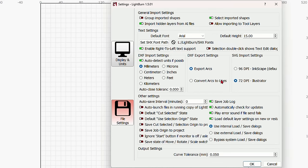So what's going to happen here, let me show you the preview. Before it cuts it out, it's going to come in and do the engraving, and then it's going to come back around and cut it out. And that preview looks perfect. So I can just come to the laser tab now and hit the start button. And you'll see that the laser has started that job.